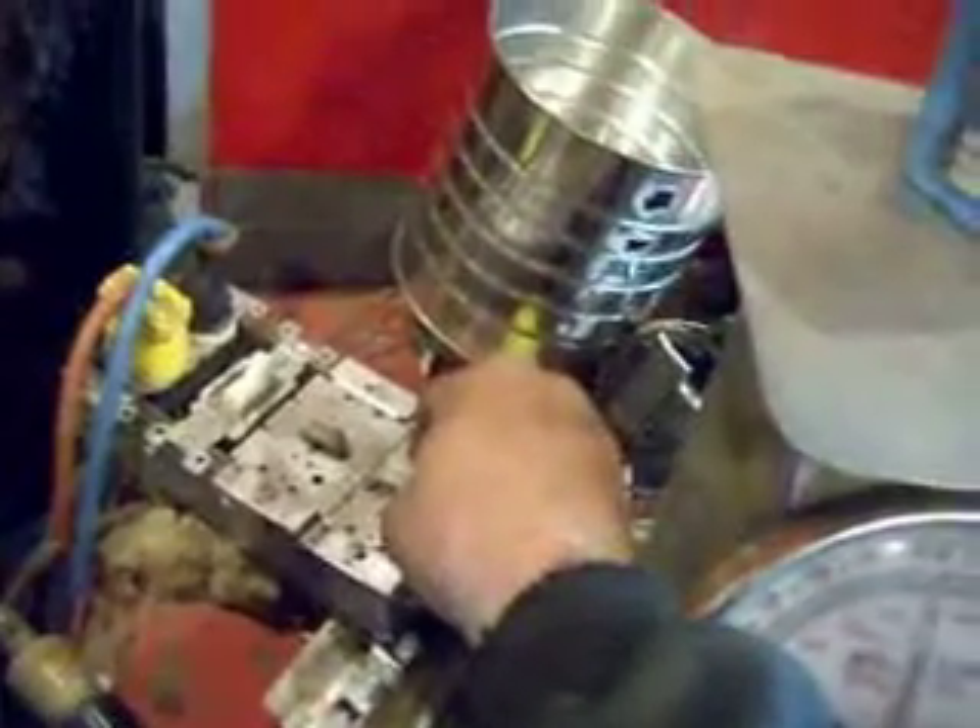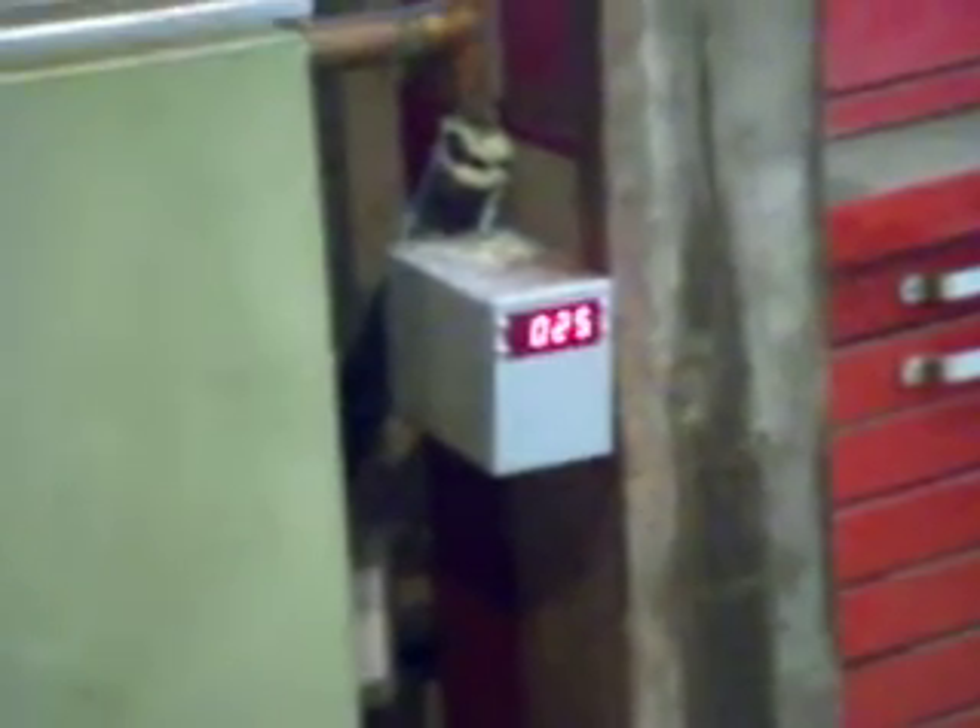I'm starting to build chips in here, so I'm going to turn the fan up a bit. You can hear the roar goes up a little. The chips are actually starting to climb in height inside here, and I want to keep kind of a status quo with the amount of chips burning in the pot. The water column gauge — I'm looking up there and it says about one inch on a five-inch gauge. The outlet water temperature is 25 Celsius.